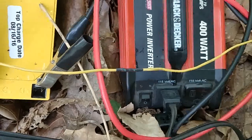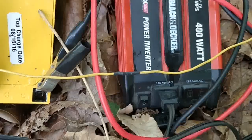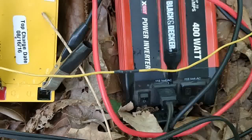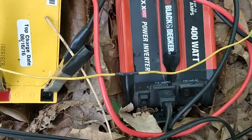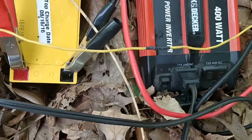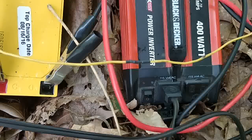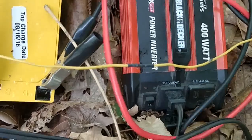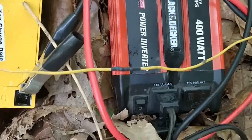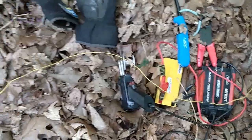There we have it — a good old Western Union type splice with a lot of heat and solder put on it to make sure it's good conductivity. First step after trimming the ends is always to put the heat shrink on the wire — you don't want to solder it together and then realize you left off the heat shrink. Put the heat shrink on, shrink it, and that should be good and waterproof and work fine for a long time.